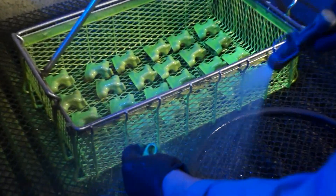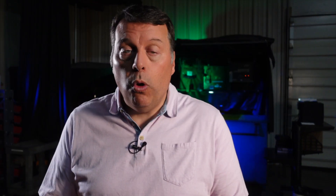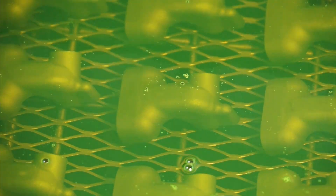After they're clean, we apply a level 3 high sensitivity fluorescent penetrant. We do this by submerging the part or the component into a bath of the penetrant. After we put them in a bath, we rinse them off — washing the excess penetrant off of the parts.